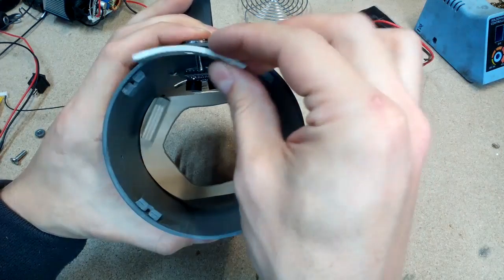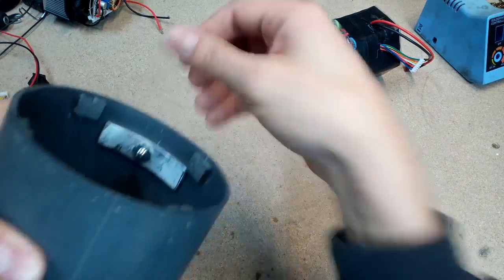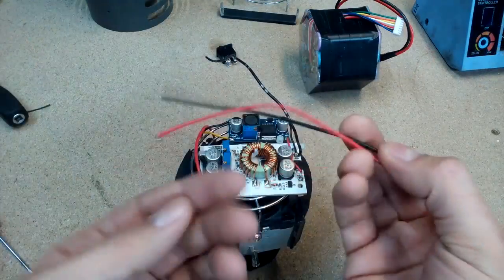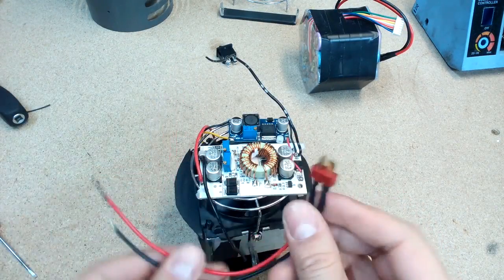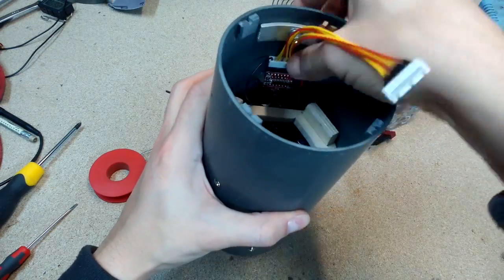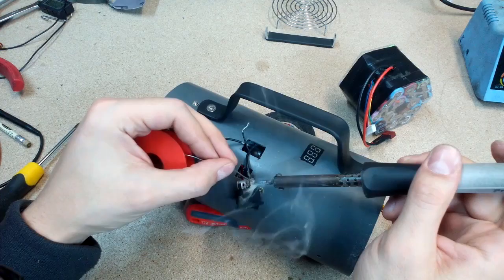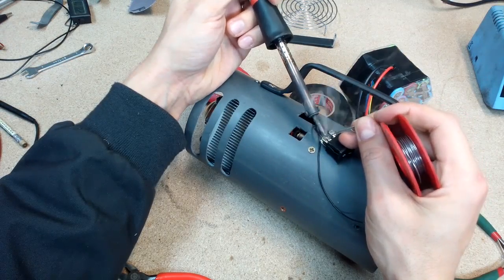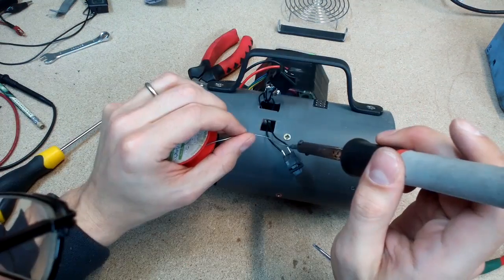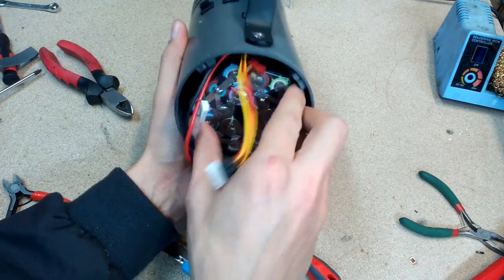To get more strength, I made two aluminium brackets to distribute the flashlight weight over a wider surface. Soldered the positive wire to the booster. Connected the balance wire extension to the voltage meter. All negative wires are controlled by the power switch with four terminals. Mounted and connected the battery pack.